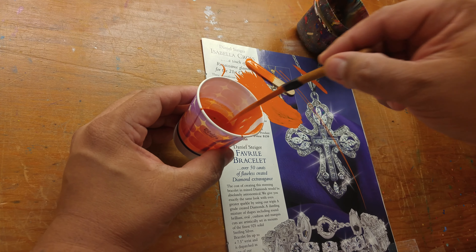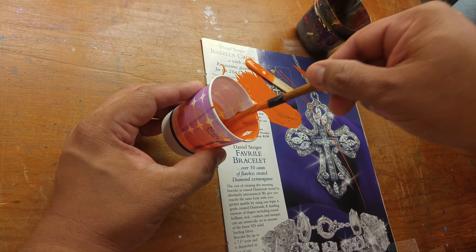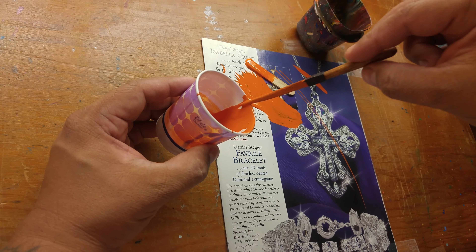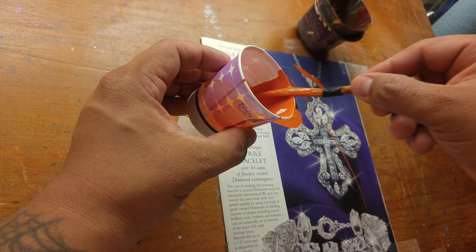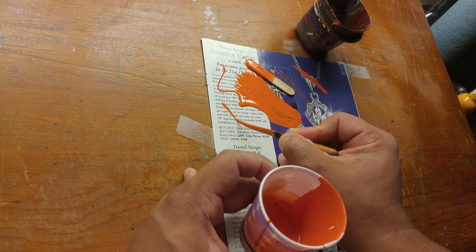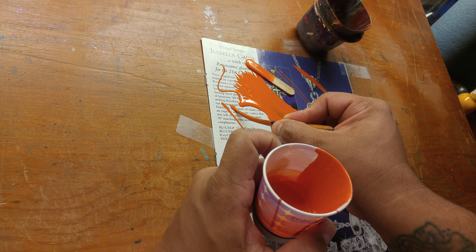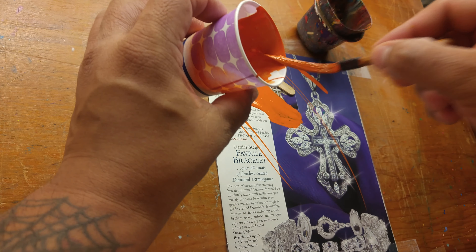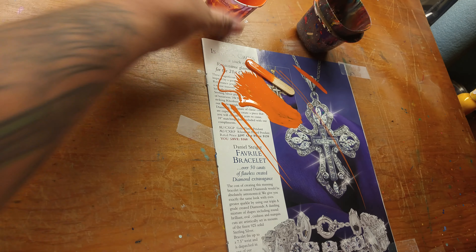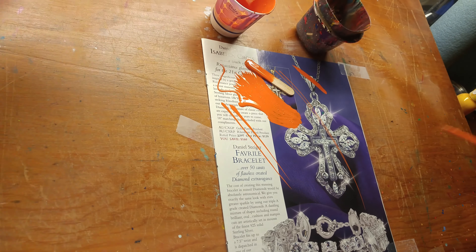What he'll do is dip the brush in the cup and just swipe on the side of the cup. That's something he understands better than I do, because this is not a method that I personally use. But it seems to work for him very well. From what I understand, I wish I would have learned this method first, because you can kind of just carry the paint with you everywhere you go and you don't have to keep coming back. When you need to reload, you just reload with the cup. You get set up so you always have the cup in your hand, and you just learn how to balance it that way. It does seem to be a kind of old sign painter's method of doing things. I think it's a pretty good way of doing it.